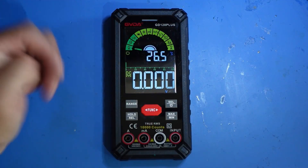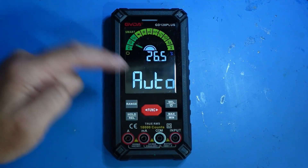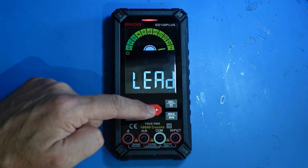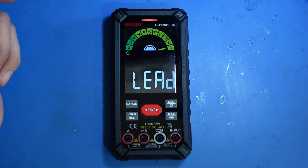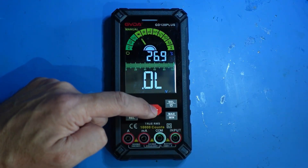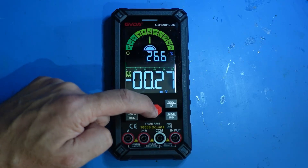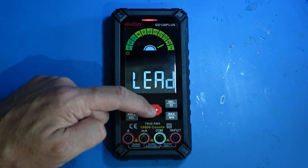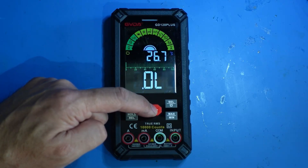You've got four connections here. Sometimes if you're new to multimeters you won't know where to plug your leads. But as you select your function, the meter will flash the relevant ports five times to tell you where to plug in. So for auto you use these two, but if you go to a different mode it will flash the appropriate two connections five times. Most of them use the two end ones, but occasionally some modes use different positions. That is a really cool feature.